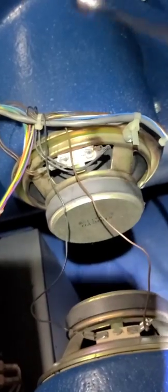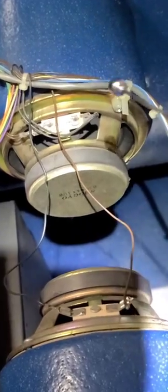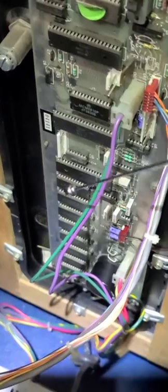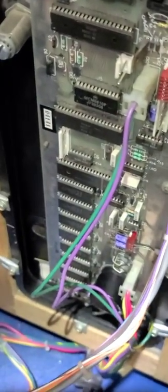If you're having sound problems and your speaker connections look good, a lot of times if you don't have sound, it's these connections that have come loose or corroded. These chips from this long one here down are your sound chips. You want to re-seat them and check for corrosion or bent pins — those will be where your sound issues come from.